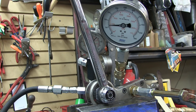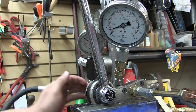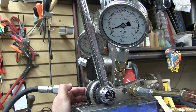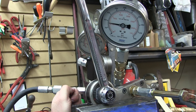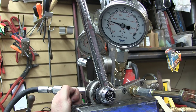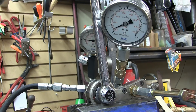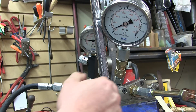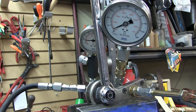She's getting tight there. I've got to get a better purchase on this. Works perfect — 192 foot-pounds on the input, clicked over at 1,000 on the dot. Surprisingly accurate even at the low end — clicked over right at 500, or depending on the parallax, maybe a little bit over 500. Dead nuts on the money. Tweaked her up to 192, which should be 1,000 foot-pounds.